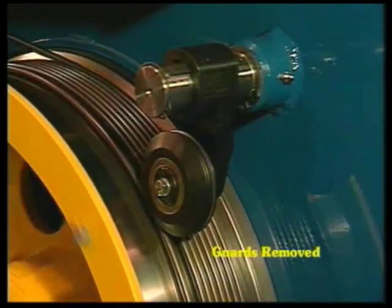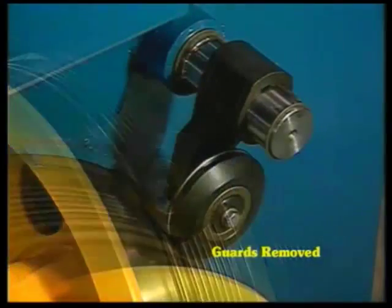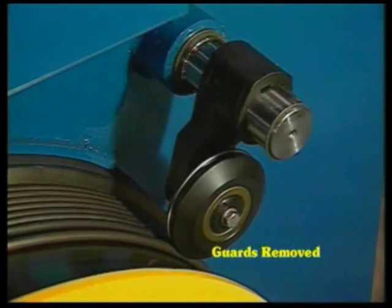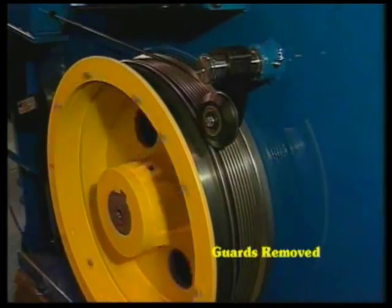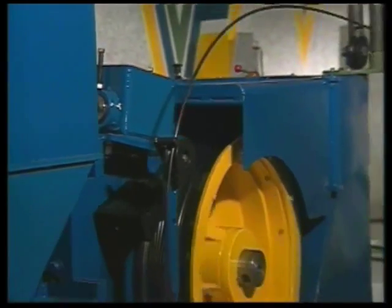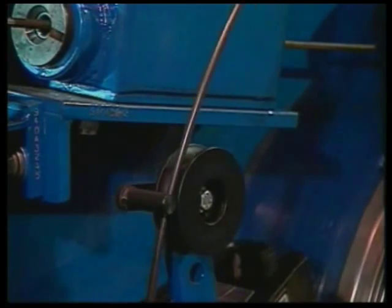Auto draw features as standard equipment this patented wire relaxer. The one-way clutch roller continuously clamps the last loop around the capstan. All the loops stay tightly wrapped for maximum traction and little or no slippage. The wire relaxer helps reduce tension on the wire to prevent kinking, ensuring a smooth flow of wire for maximum uptime.